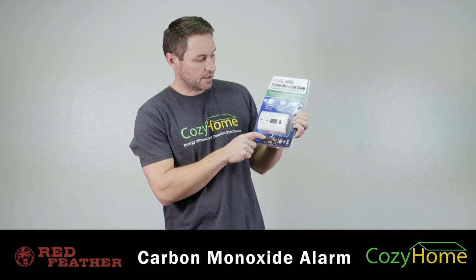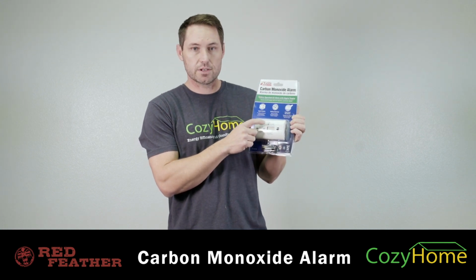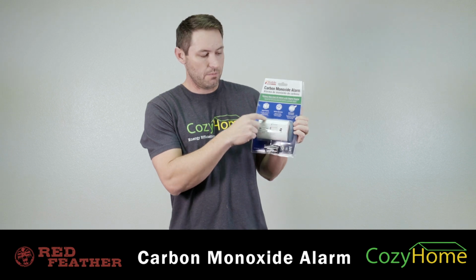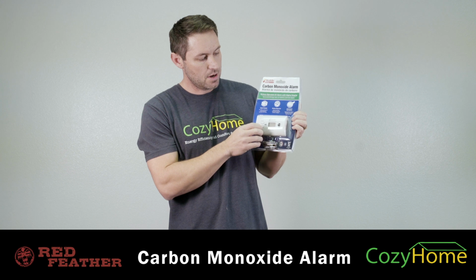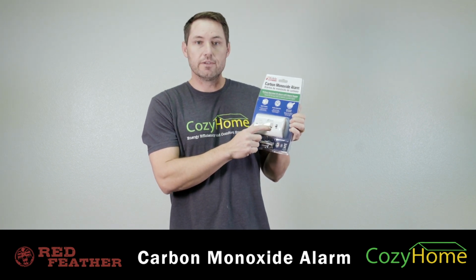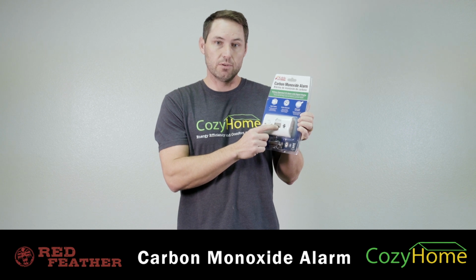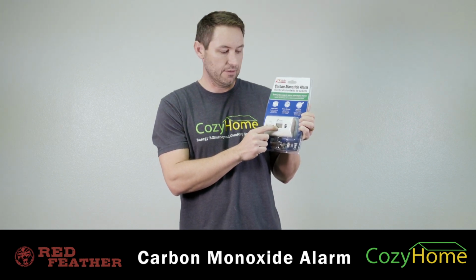It comes with batteries. It's real easy to install. There's some screws as well, and so this just screws onto your wall. There's a little mounting plate in the back of this that comes off that you can screw to the wall and then put the carbon monoxide detector on that. And this one actually has a readout of parts per million as well that will show you how much carbon monoxide is actually in the air at any given time.